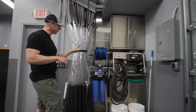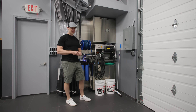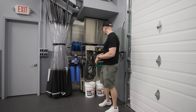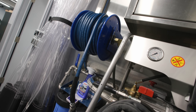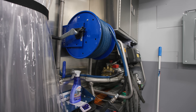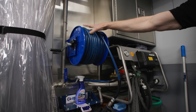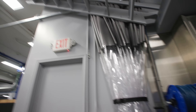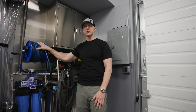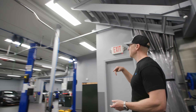Starting in the corner here — this goes back to the very beginning of me doing pressure washing and systems. A lot of Gen 1 stuff that I was originally putting into designs and projects. This is the KWS 700, the 20-millimeter pump. Certainly not necessary for washing, but it does 3.3 gallons a minute at a thousand PSI. This system was the very first where we offered the option of a hose reel or boom pole.